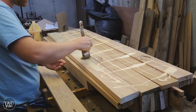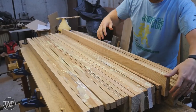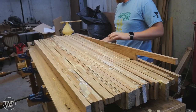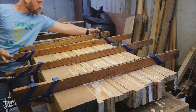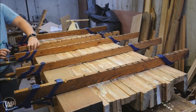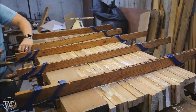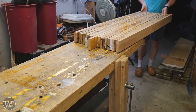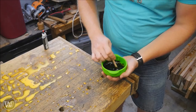So I'm just slopping on the glue — I used quite a bit for this. I was going to use a glue roller but I couldn't find mine, so a brush works perfectly fine. Then one by one, or in this case like three by three, I go through and pull out all the pieces, laminate them together, and put on a bunch of clamps. Now I have a big beam on the side closest to me — that beam is there to keep this stack straight. So if there's any variation in my planing thickness, one edge will be perfectly straight and the other edge will be bowed, as opposed to both edges being bowed. And that was very important later on, as I found when I took it out of clamps that there was a large variation, so I have one edge that's perfectly straight I can go off of.